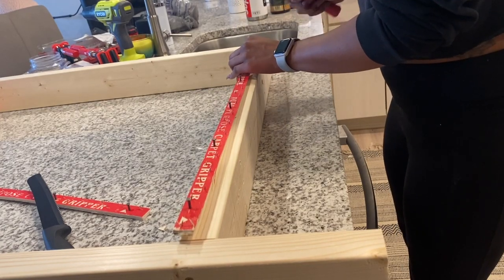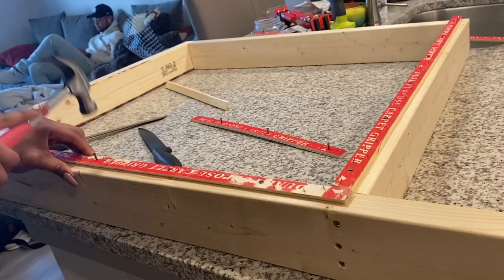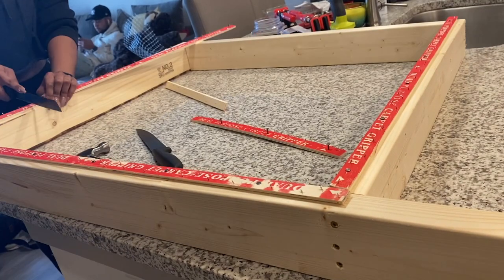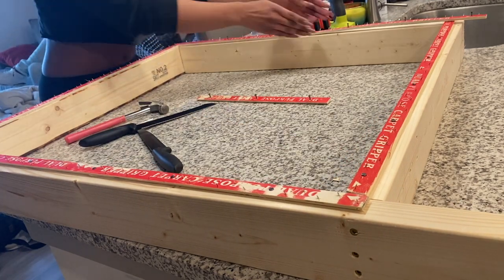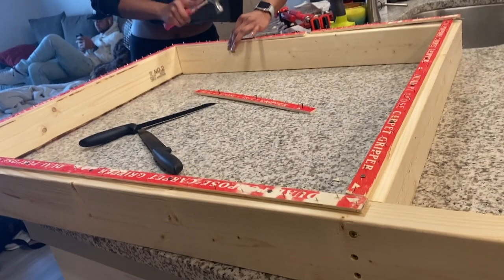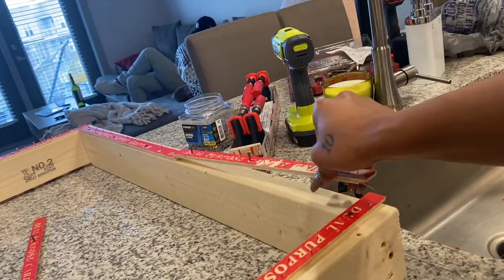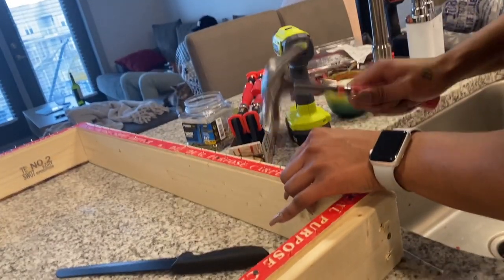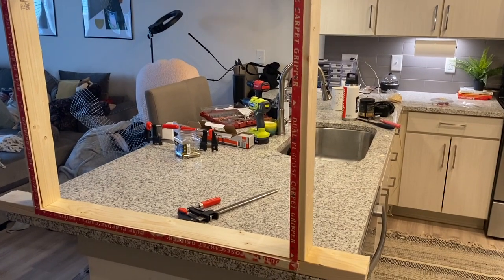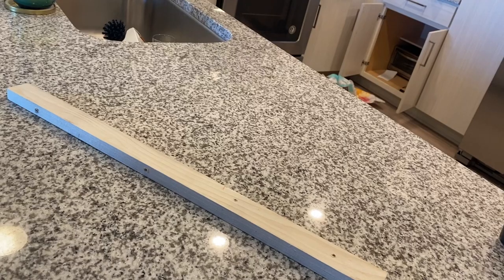I'm going to do the same process on every edge. Something really important to remember is that it does matter which direction you put the strips in — I'll give you an example of how to put them on to make sure you guys are doing it right. For the top, since I only had three strips, I put two scrap pieces together and cut them to size to make it like one. You can definitely get more rug grippers if you'd like. Make sure that when you nail them in, they are nailed in this direction — if you do not put them in this direction it will not grip your monk's cloth or whatever fabric you're using correctly.